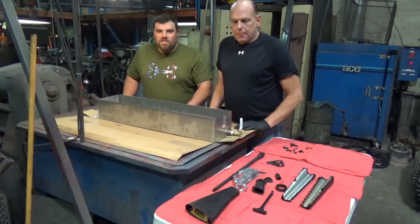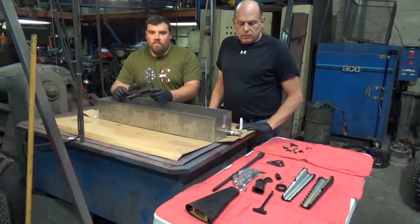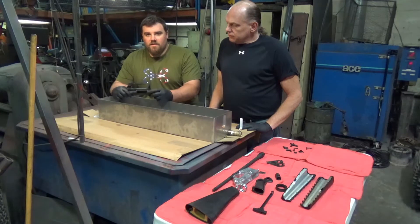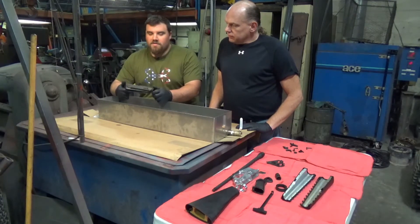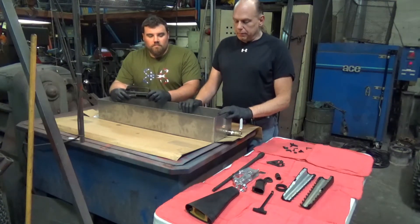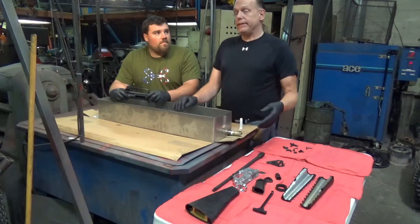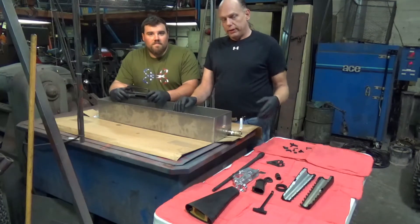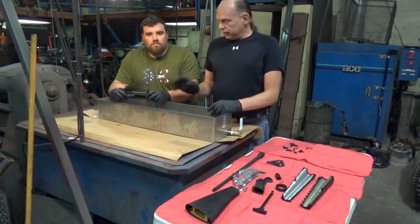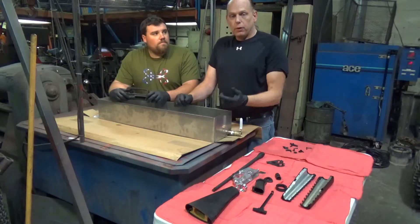Alright guys, we've moved from the war room to the shop and we're going to start cleaning our parts. We're going to clean in mineral spirits to get off all the oil and the grime before we go into the blast cabinet. We don't want any of the media to stick to the oil and crud from years of being in a lockup. We've got this fabricated pan with virgin mineral spirits - not using anything that's already oily and dirty - that'll help thin out all those greases and oils.